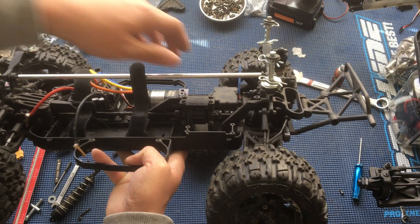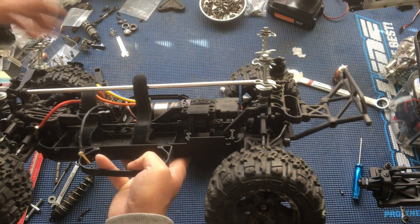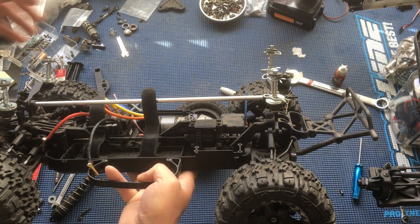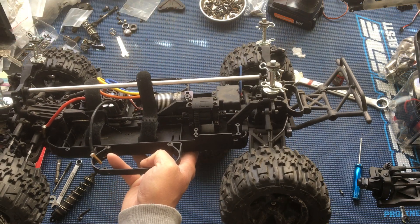Some people might be concerned that 3 millimeters is just too small for the screw here. You can bore this out to 4 millimeters if you want, but the plastic might be reaching its limit there. This tube will actually take a 4-millimeter screw if you tap it. So you could do that as well — just some ideas.